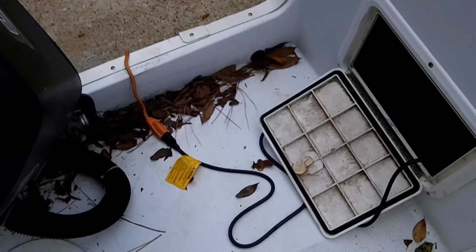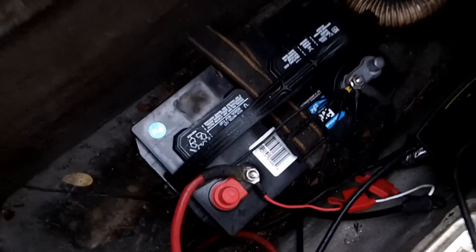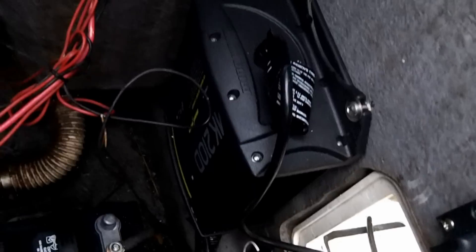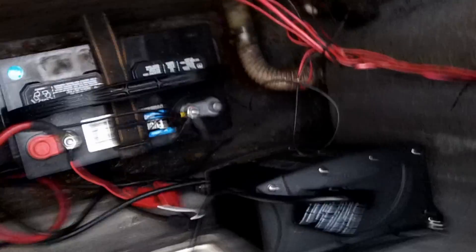It's the next morning. We had the charger lead hooked up all night. The lights on the charger last night were orange, indicating they were topping off the charge on the batteries. This morning we see green lights blinking, indicating a full charge. Once the charger goes into maintenance mode, the green lights will be solid and stay on. So here we go — a complete automatic self-charging boat battery system installed.